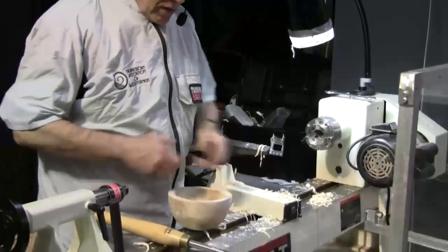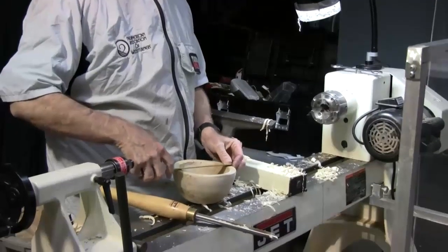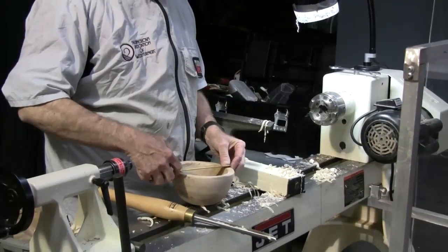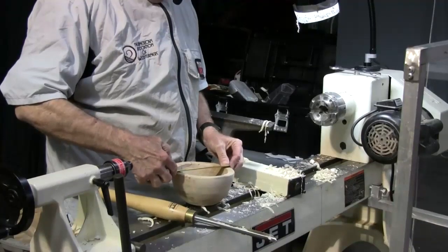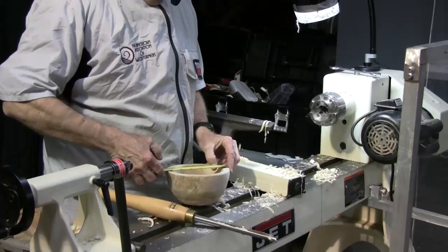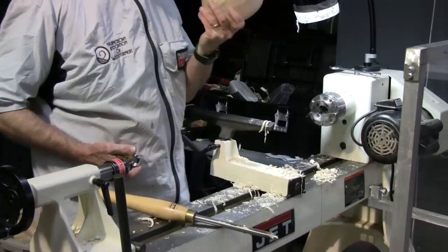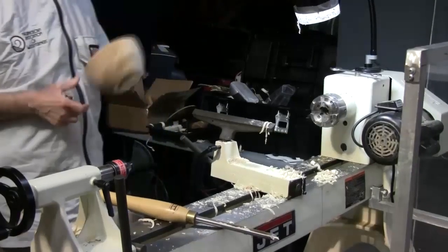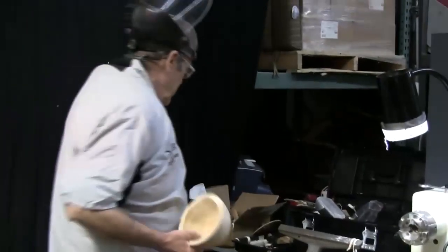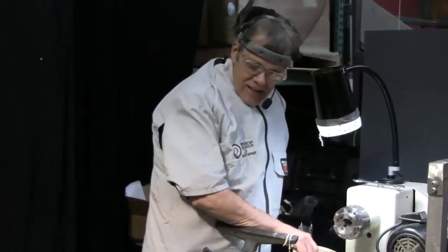Let's just see how much movement there's been. Some species will move — if you use sweet gum you're going to have a lot more of a problem with movement than you would with ash or walnut. In this case, it's just a little over six and a quarter that way. There's not a sixteenth of an inch difference in the two directions on this silver maple three weeks later, and it was out in my garage. It'll probably still move; I'm pushing it.